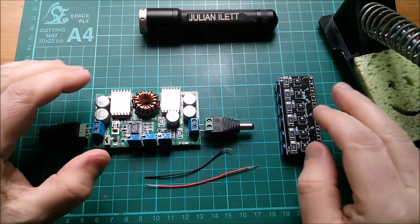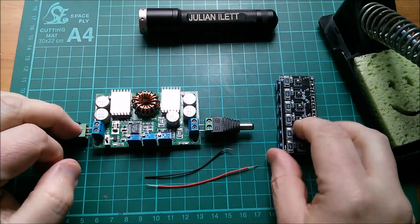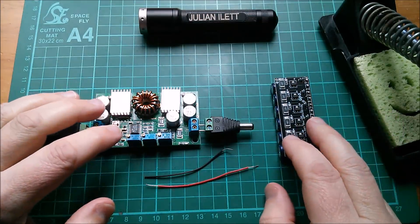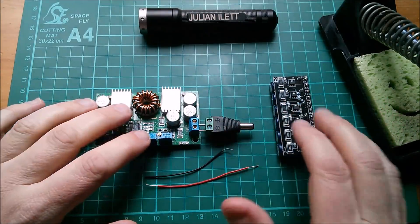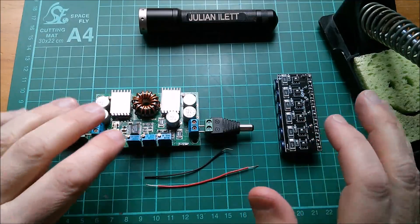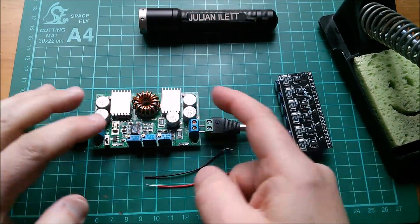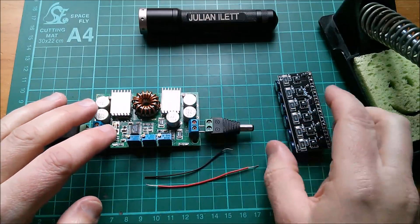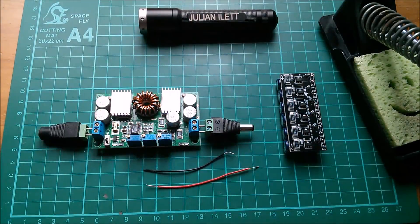You could ask why I'm doing this without a diode. There's nothing stopping me putting a diode in this circuit to prevent back feed from the supercapacitor bank into the power supply that's charging it. But I'm just interested in what the actual issues are with back feed. Is back feed going to cause damage to either of these two units? I can't see it causing damage to the capacitors. And how much back feed is there? How quickly will this tiny bank of capacitors discharge back into this unit? I just want to see what happens, so I'm going to do it without a diode.